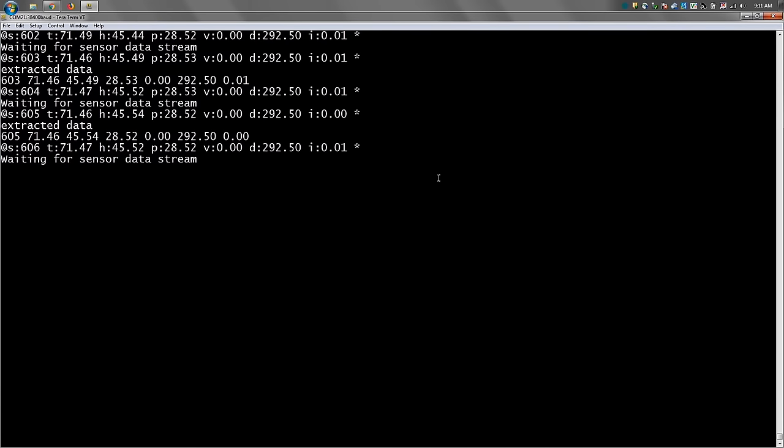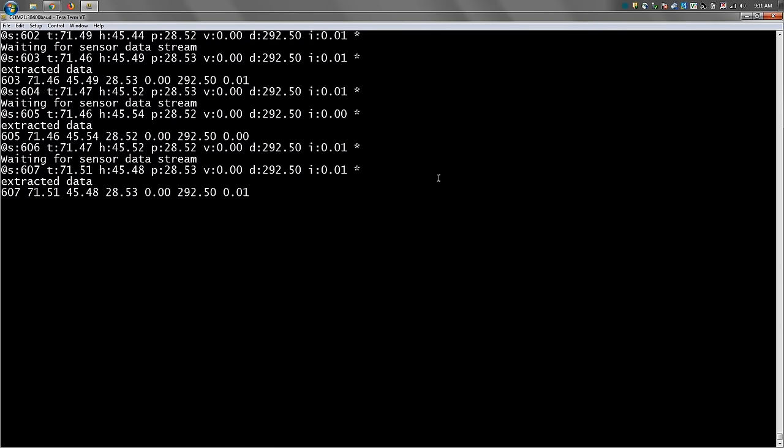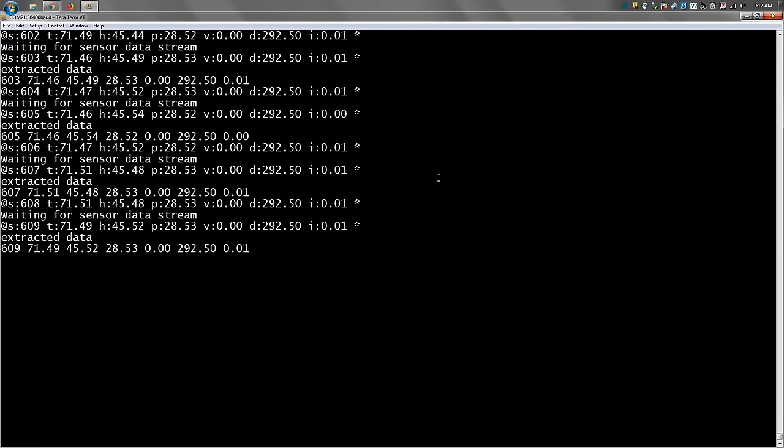You can look at the design and easily integrate it into one board, but I will give you a bit of warning or guidance, since I have quite a bit of experience in environmental monitoring from my previous career: you really don't want RF systems near sensor decks. Typically this sensor deck really needs to be up by the anemometer. The UV sensor needs to be covered in glass, and be careful of the glass, because certain glasses filter the UV, so your UV index is going to be false, zero.